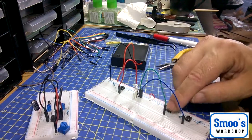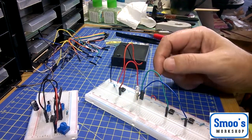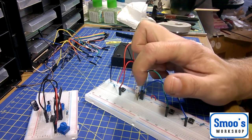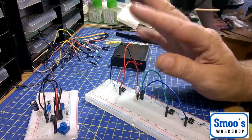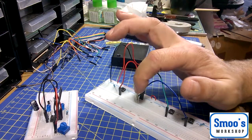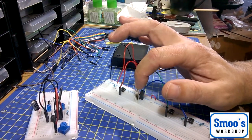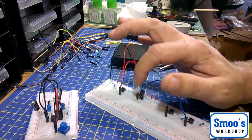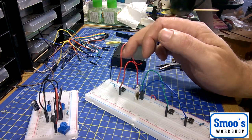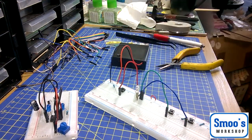You can get the ones like the Christmas tree lights that only have 2 pins on and there's little circuitry inside, and it just does random effects with the red, green and blue without having to do the 4-pin independent wiring thing. So this is a 4-leg common cathode, so common negative. All the positive feeds to the different ones have to go in on a different resistor for each LED.